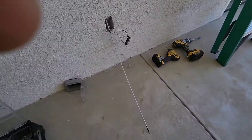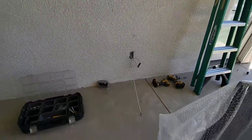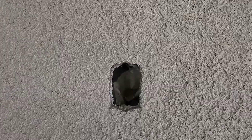So how do you do that? Check this out. First step: pull that outlet out. Look at that hole I got drilled on top of that box — do this very carefully please. I drilled a hole and I ran a fish rod. What I'm doing here is checking for horizontal fire blocks. A fire block is just a wood between the studs horizontally, and I'm clear.